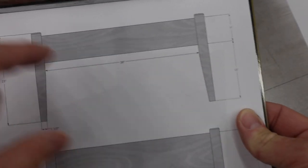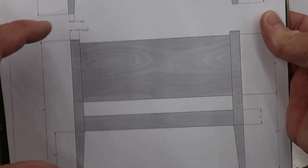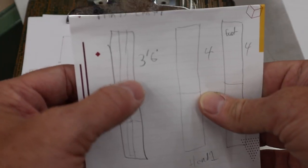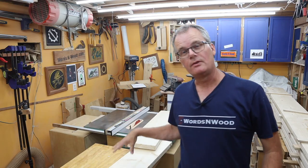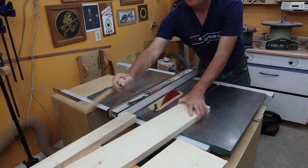The legs are two and a half inches square — at the footboard they're 23 inches tall, and I need two of them; at the headboard they're 37 inches tall. I made up a plan which tells me one 2x10 is enough for the legs. I'm going to rip the boards into 3-inch pieces and then joint and plane them a bit before gluing them up into the leg blanks.